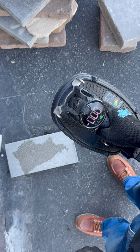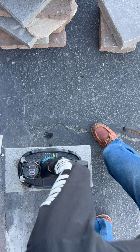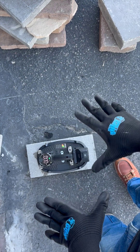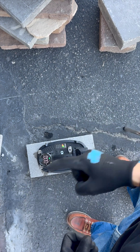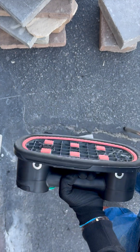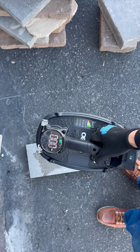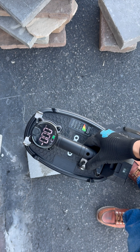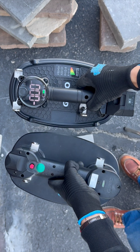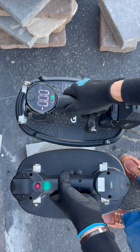This tool can pull more air than the material can leak out air. The new High Flow will pull more air than the material will leak out. The vacuum on the standard tool pulls in 20 liters of air per minute. Compare that to the new Grabo High Flow — this pulls in, get this, 1,500 liters of air per minute compared to that 20. That's the solution. That is the science behind permeable pavers and being able to get a grip.